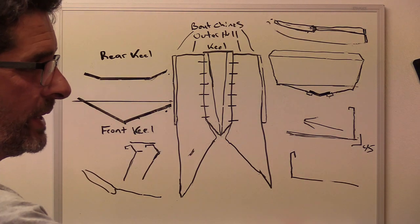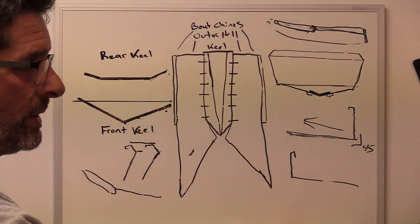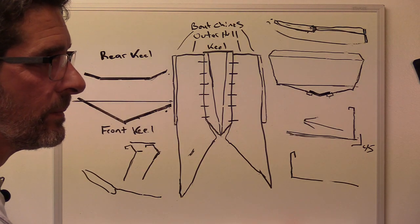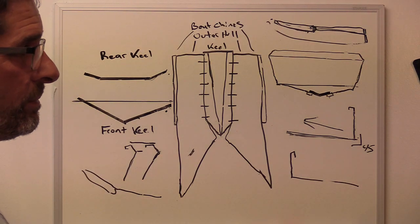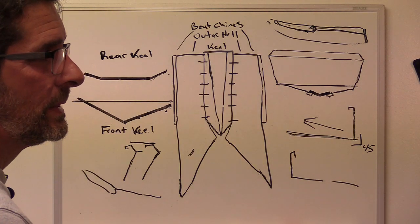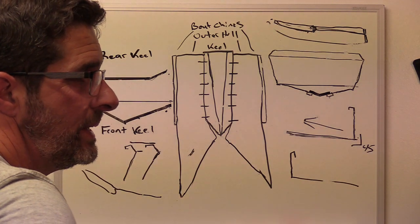And you can do some simple things like when you're putting the side panels on. You know, if you're looking at the rail on the side panel after you got it tacked all the way to the front corner, and it's bowed down, it shouldn't be. It's pretty stiff metal. It shouldn't be bowed down in the front, you know. I didn't know that at the time, but there's no reason for that. You know, it's set by the bends.